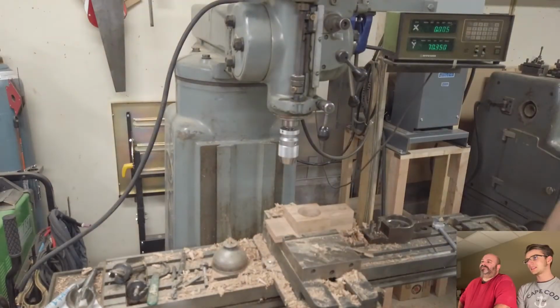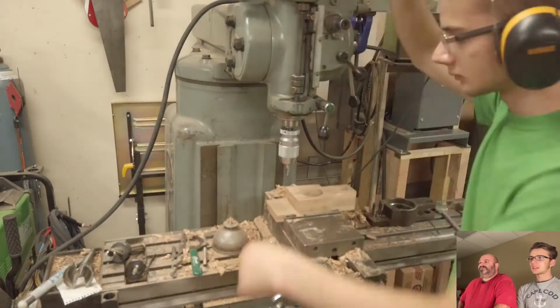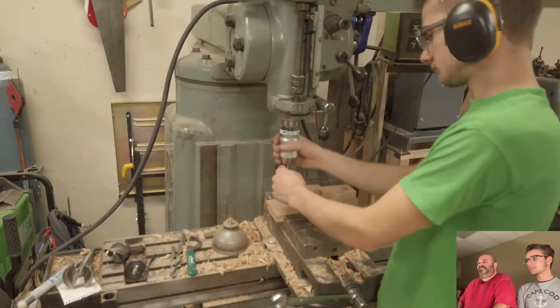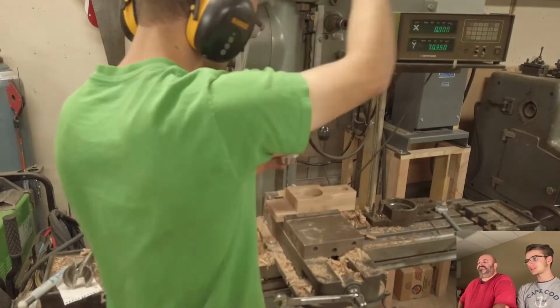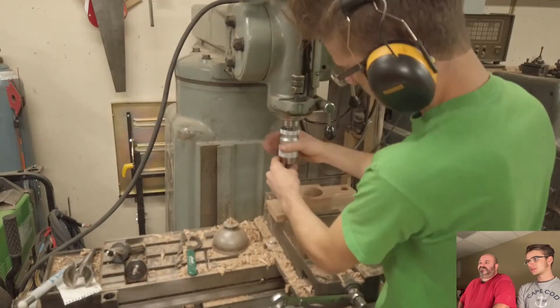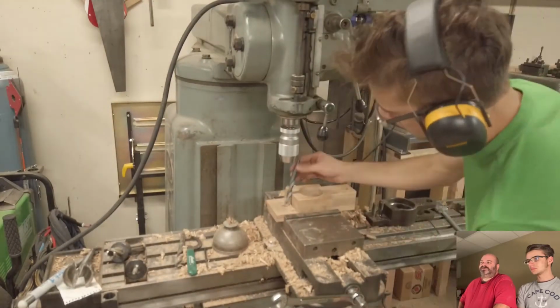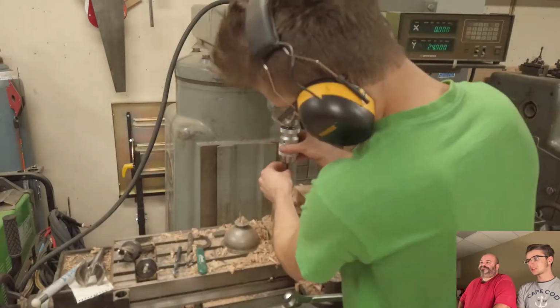It was a pain in the neck to get the bolts that stick up out of the mortiser. I still couldn't get quite the right thing, but it worked well enough. They're a special bolt with like a knurl on it. So you drill a slightly undersized hole, then you hammer it up through, and the knurls engage with the metal. It's a press fit threaded rod. Right. I'm sure somebody sells them. Somebody does. I don't remember who I bought them from, and I forget what they're called.